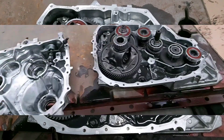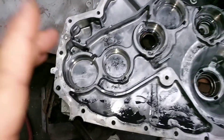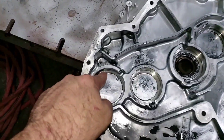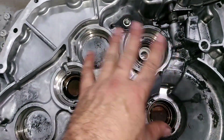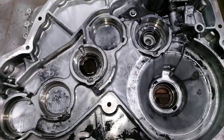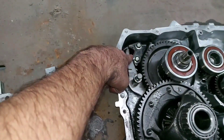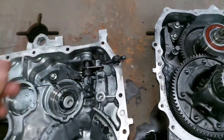One thing to be very much aware of before assembling the main cover back: make sure all your separator washers are in their proper position — use a little grease to hold them in place. Also make sure this little rod fits directly into this hole over here.